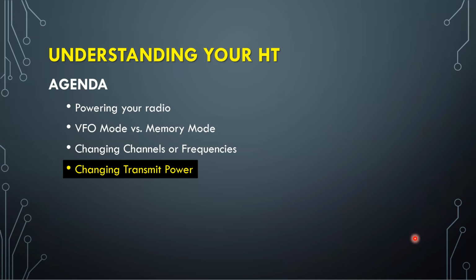Okay, a transmitter. So I'm talking at 5 watts, and I can talk to somebody in Lehigh off of 5 watts. Actually, I can turn it down low if I can see the repeater, right? So I'm talking 1 watt into the mountaintop, and that mountaintop repeater is retransmitting that signal, so I can talk to people in Lehigh. The reason why I ask is that I'm in an ATV group. And when we get out in the middle of nowhere, we struggle trying to hear each other. And often it's because the guy's just over on the other side of the ridge.